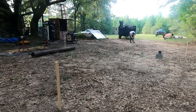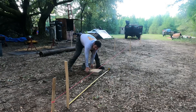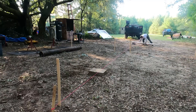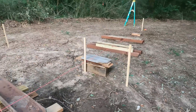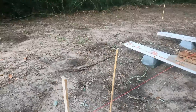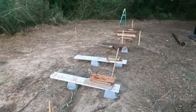I'm going to use this laser to go ahead and rough in the elevation without having to flatten all this dirt, which I don't think my friend wants me to touch. I'm just going to place these boards where I need to go, so the laser helps me get them to a rough height. Then I can come back with the laser again and use a story pole to set them at the precise height.